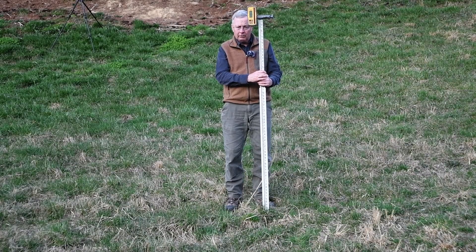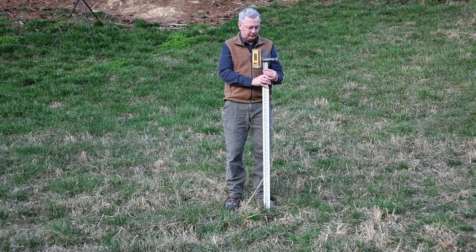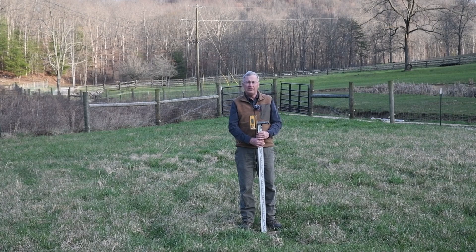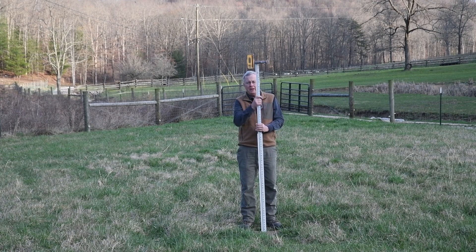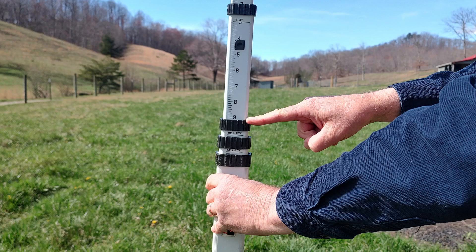I'm going to take a reading uphill and see what happens to the numbers on the rod. I've walked uphill, so I need to shorten the rod — bring down the top section until I hear the tone. It's beeping fast because I'm high. I'm in line with the laser and I see on the back side of the rod that I'm reading four foot five inches. I've walked downhill into a low basin. I'm going to extend the top section of the rod — I'm predicting we'll read a higher number because we're in a lower spot. I listen for the tone — it beeps slow because I'm low — now it's right on with a flat tone. Looking at where the second section of rod connects with the third, I'm reading seven foot nine inches.